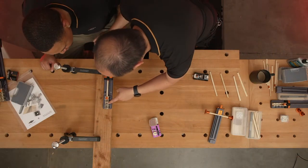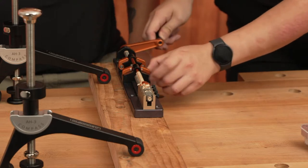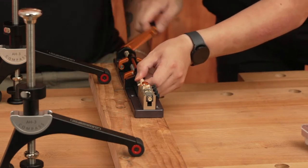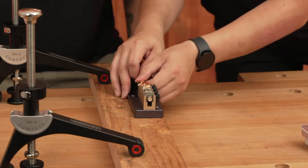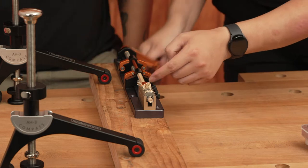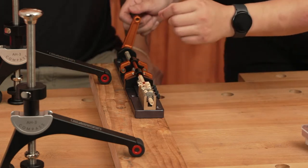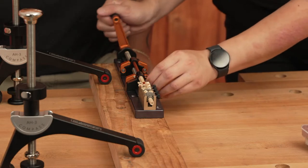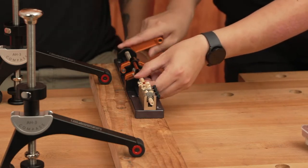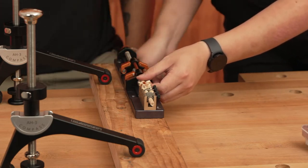But what you see is that it's starting to push the blank all the way through, just like so. And I have to make sure I guide this. It seems that what happens is if it gets stuck, it's because the blank itself is getting too much, or we're pushing too much, and it's forcing it. Right. So we just have to back it up. Just back it up a little bit and then guide it through. See that? It's starting to get stuck. So I back it up just a little bit to allow some relief and then continue forward like so.